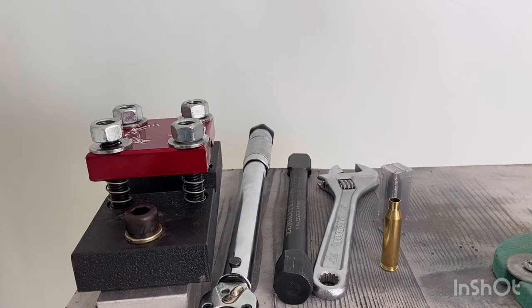Next you'll need some sort of wrench for the barrel vise to tighten it down — I just use an open-end adjustable wrench. Some of the most important pieces are a go and no-go gauge. I didn't have a go gauge available, so I'm using a piece of sized and turned ready-to-go brass instead. Use caution doing it this way. It'll be safe as long as the no-go gauge does not close. Just double-check because tolerances can stack.